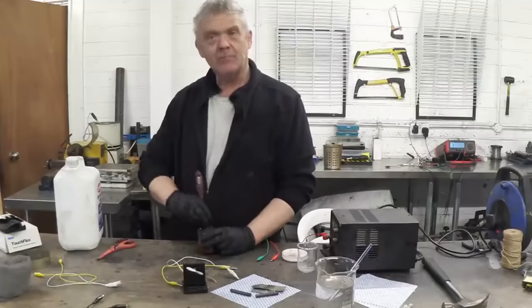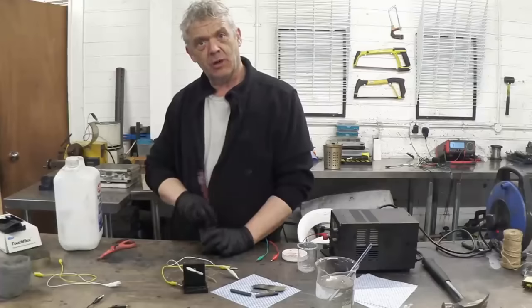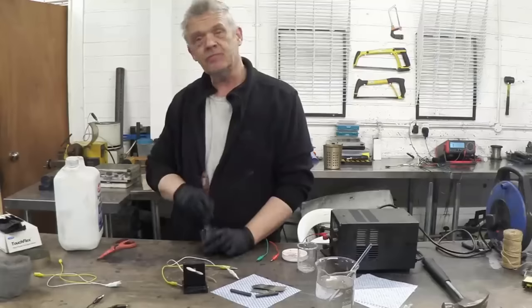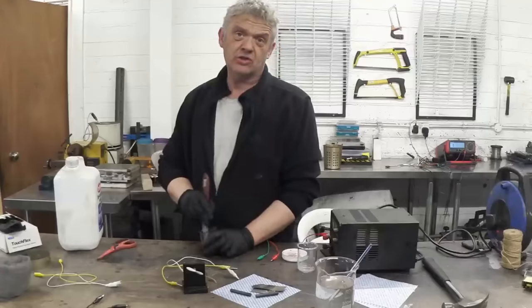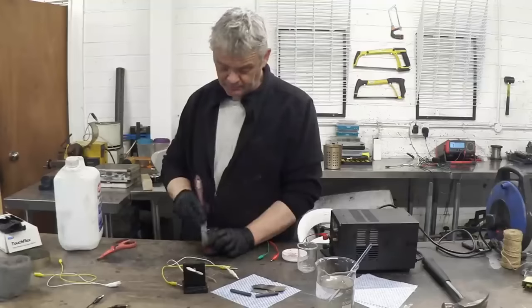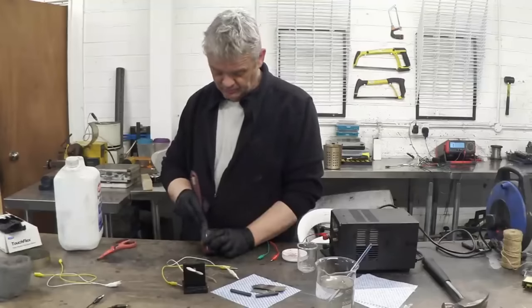Interestingly enough, the magnesium oxide and magnesium chloride act as a kind of geopolymer. And that really should be quite exciting to you. It is exciting to me. Because if it acts as a geopolymer for the copper oxide, could it act as a geopolymer for other oxides as a way of making an oxide paste that would be self-curing? Certainly worth some investigation.